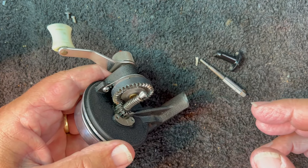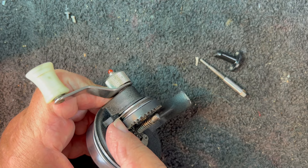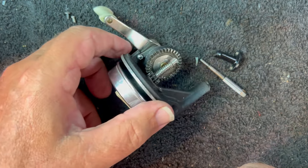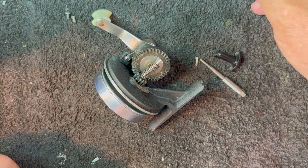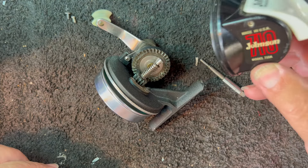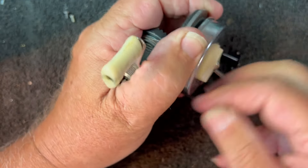He also informed me that this is not a 710A, because in the 710A they did away with this anti-reverse spring. So this is actually a 710. Let me go look in my parts pile and see if I have the cover for a 710. It turns out I had side covers for a 710, another 710A, and two 710Bs, but no basic 710. So we're going to have to stick with that one right there and pull this apart real quick to assemble it the way it should have been.